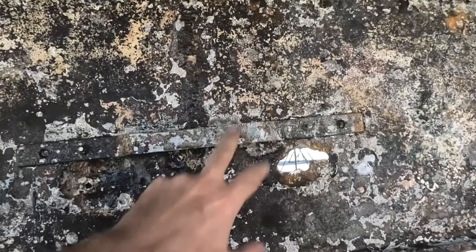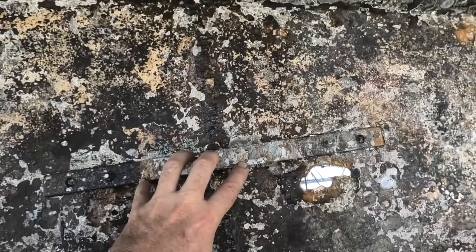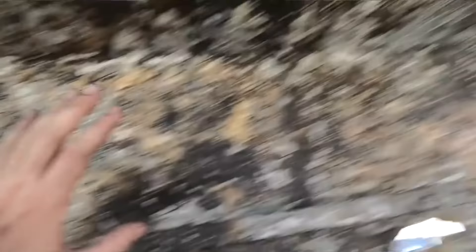About the worst of it is that the anodes have been eaten away from the water completely, and there's a hole through the keel where the anode strap is closest to the mild steel. About the only thing that would probably be worse than the anodes being completely gone is being not gone at all because they weren't well connected to the hull — so that's something, at least they did their job. The hull itself doesn't look too bad — there's a few dodgy spots, but by and large it actually looks alright, which is good.